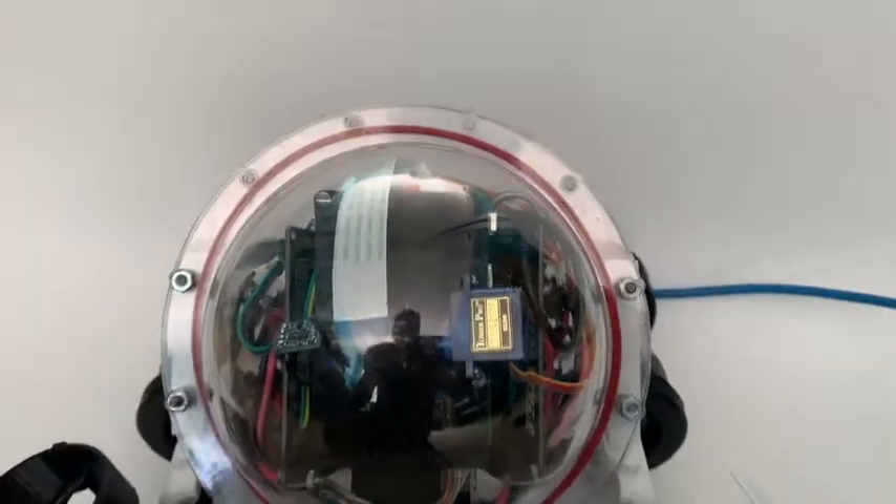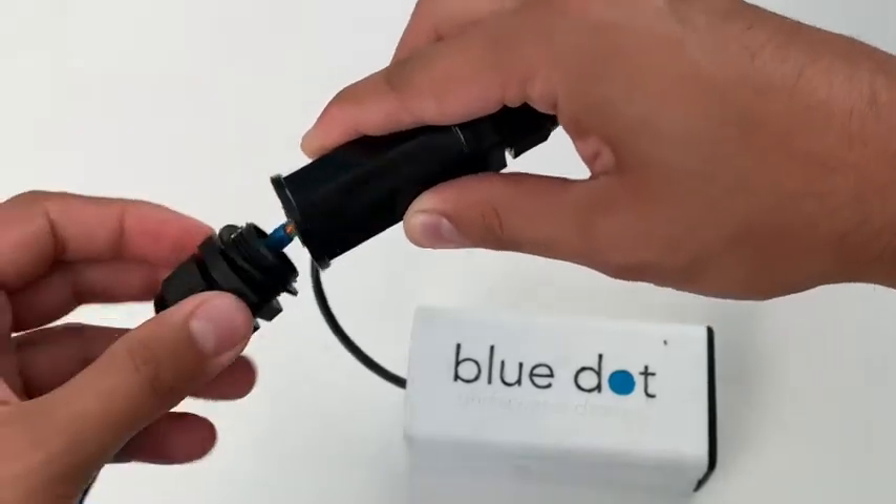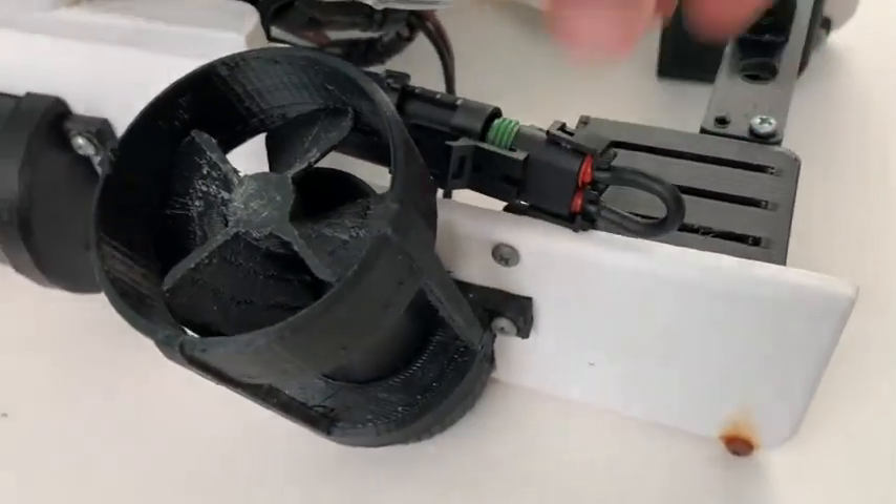To do this I'm going to show you how to do it with two GoPro dome covers. They're really good pieces of hardware because they're designed to keep electronics dry underwater. When putting together our ROV kits, we drill 11 holes into our domes — one for the Ethernet connection and the other 10 supply power to the motors and to the key you use to start the ROV.